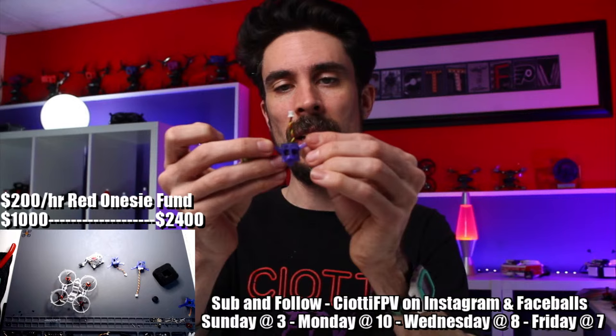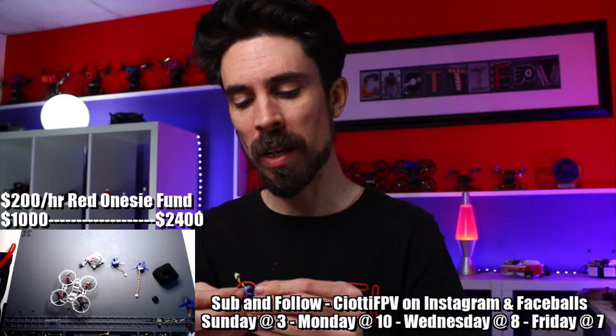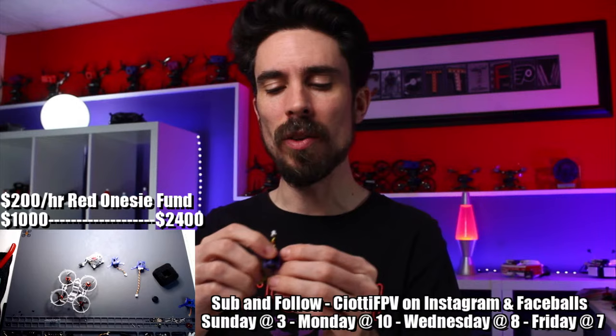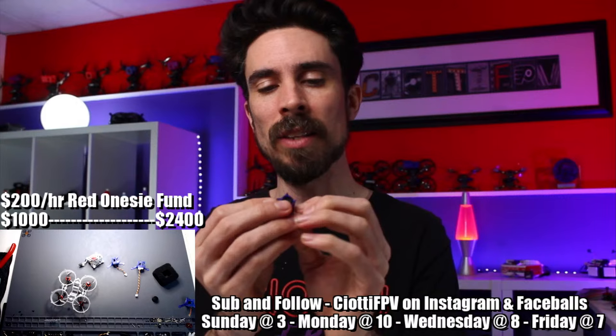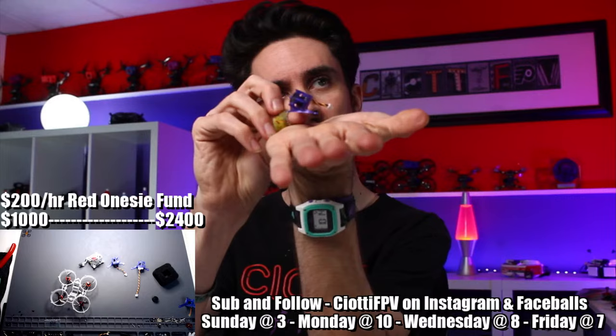So the 199, I don't know what mount you're going to run for the 199. There are tons of Tiny Whoop camera mounts. There might even be a 199 mount on Thingiverse. You know what? You could put it in this big McStinky mount and then just put two little dots of E6000 on the top and the bottom, and it would hold it in here totally fine. This is actually fine. These mounts kind of grip onto the lens, and they hold the lens really nicely, and that's what's going on in this case. I would not fly this like hard freestyle like this. Although, even if the damn thing slides out, it's not really going anywhere because this is braced up against the AIO. So it would probably be completely fine, to be honest.